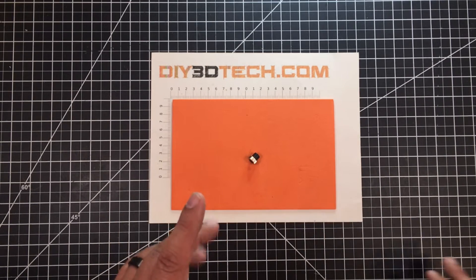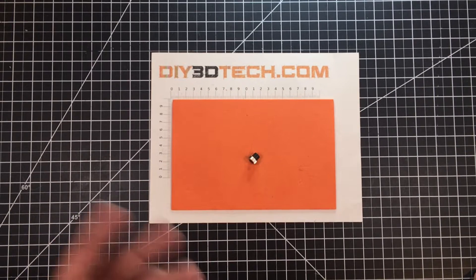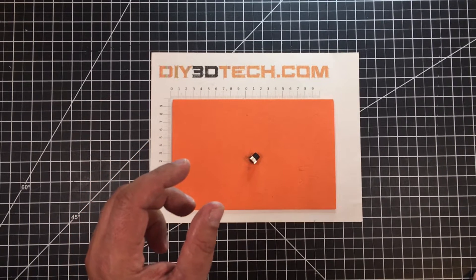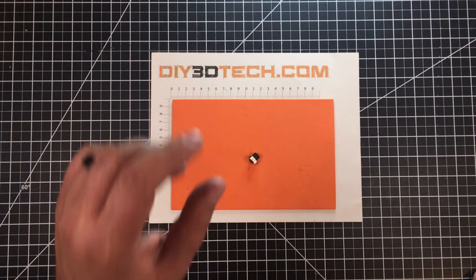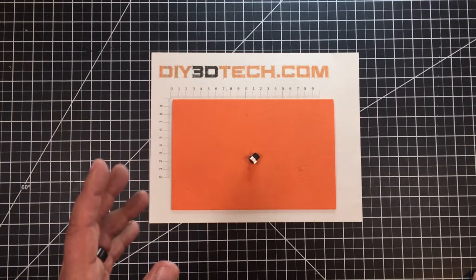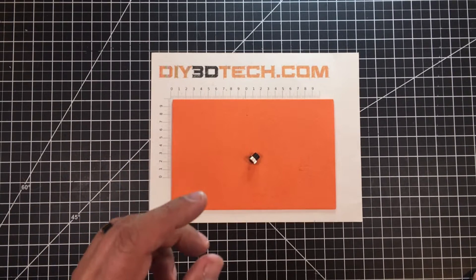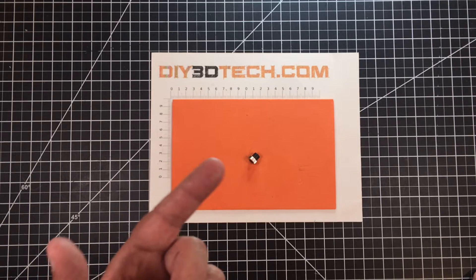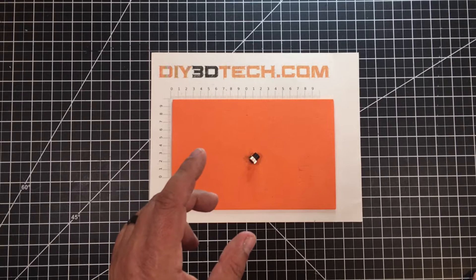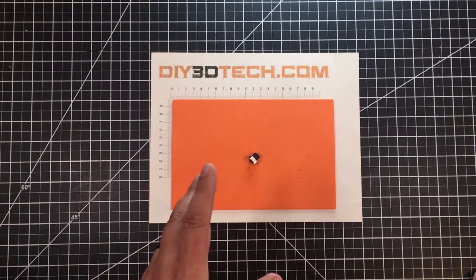This is a single element lens, and for those that don't know, the common numbers — at least that I'm familiar with — are G2, which is a very short focal length, and then there's G7 and G8. G8 has a much longer focal length. They claim that the G2 is better for cutting because it's closer and you have less dissipation in the beam, but they claim that the G8 actually works better because of the single lens, less lens absorption, and less sporadic reflected light from the laser itself.